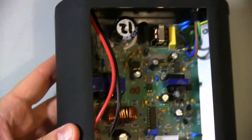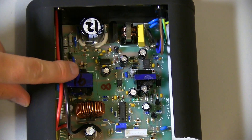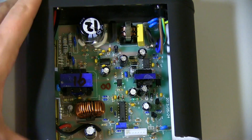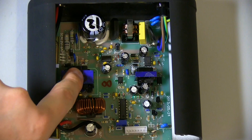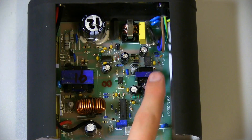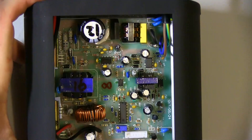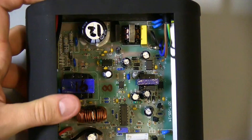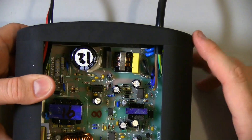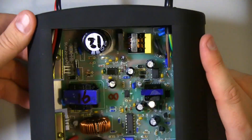This is the voltage and current source going out to our battery. We've got a transformer here, a big inductor here, and some other bits of silicon. There's also this little transformer here which is probably some sort of flyback arrangement — just looking at it. Got a few caps around there, and they've got some opto isolators — so that's probably what they're doing with that. They're using Texas Instruments parts, which is good — I mean that's quality.